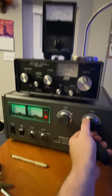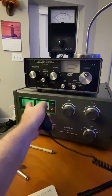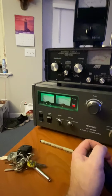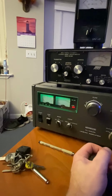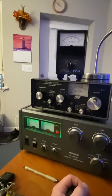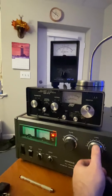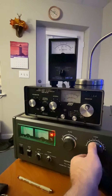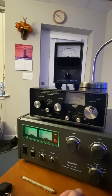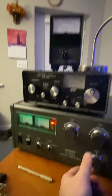And this is where, again, keep an eye on your grid current. You don't want that beyond 200, 250 milliamps for long periods of time. It'll launch your tube into outer space, and they're not cheap. Anyway, we're keying up here. We see where max is, right? On the load, it's number 2. That's for max.